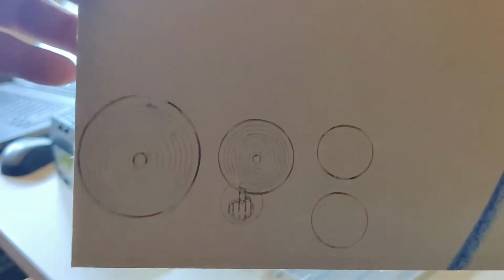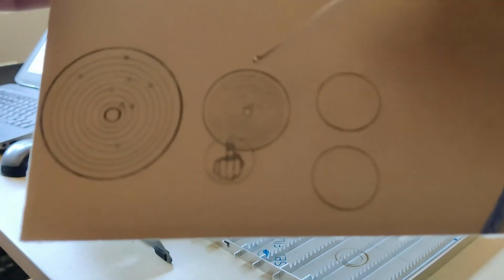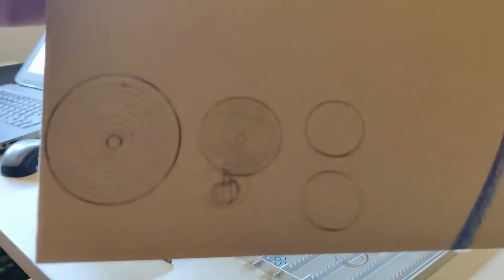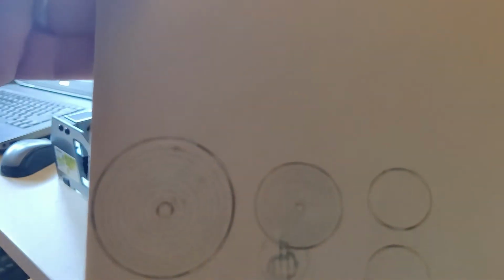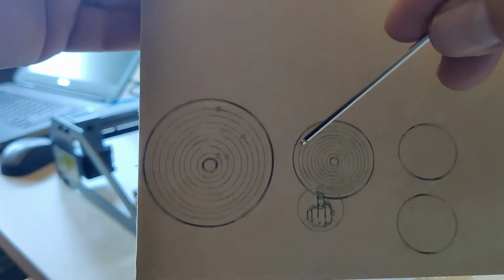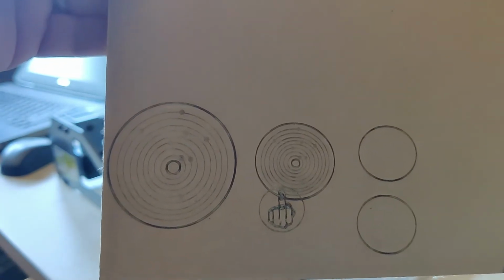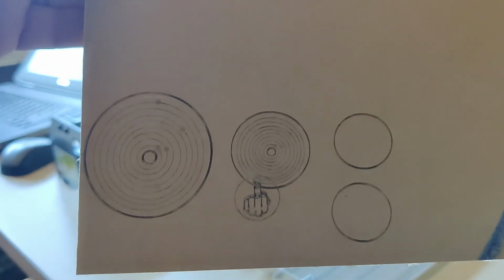And then, I don't know, it's probably not going to show up. We'll see. But you can also tell that this whole top section and this whole bottom section are good and dark. And then anything on the sides here is really, really light. So in the x-axis, as the laser head's moving around, it's losing power here, picking up power, losing power here, and it did that consistently. It did not matter which G-code I used, or if I used LightBurn, or LaserWeb, or LaserGRBL.